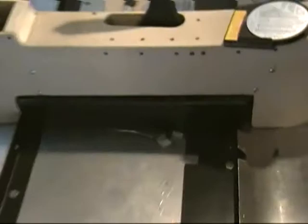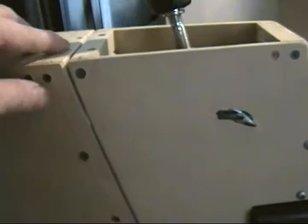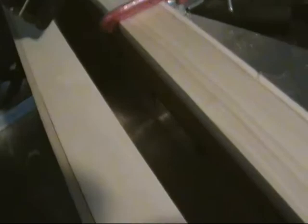I've done quite a bit more work to the console. I took this back out and cleaned it up, ground this down so it's all smooth, got some nice edges. All the screws are indented so I'm going to fill those up later. I've been working on the front half — last time I had my keystone block put inside here. Now this is completely screwed and mounted to the keystone block, along with screws going through into the aluminum angle pieces that I put inside down in here. The aluminum angle holds it on, with some sheet metal nuts holding it in place. I put the aluminum in the back on this back aluminum panel as well, so now that's got screws in it all the way around.